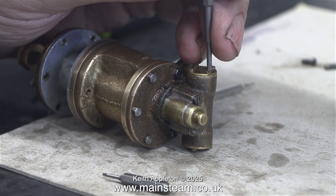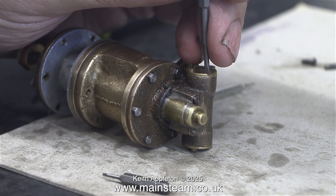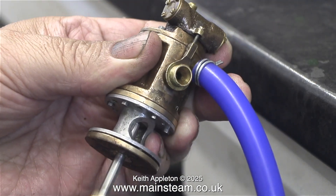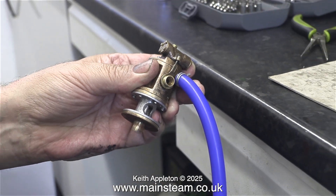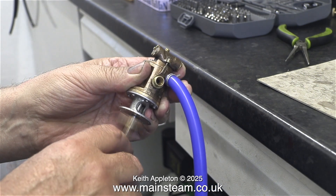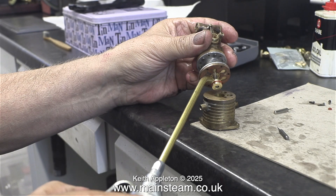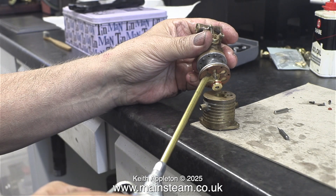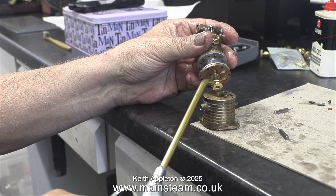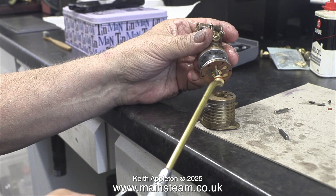After screwing the last of these tiny bolts in position without losing any of them, it's time for a test run. Is it going to work? And yes, is the answer to that question — it runs beautifully. For the initial assembly I am applying a very small amount of lubricating oil to the water piston. This is just for a test run before I pump water through it; the water becomes the lubricant.